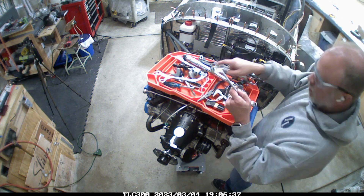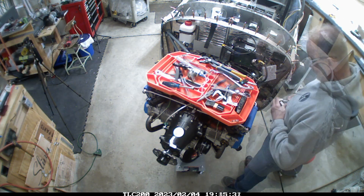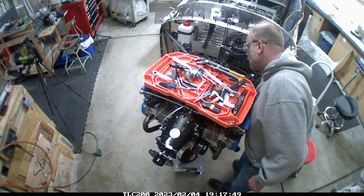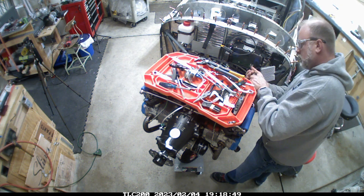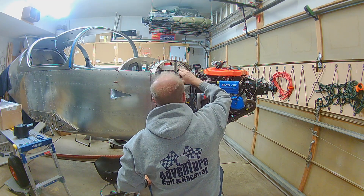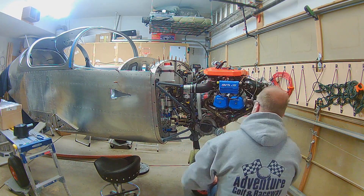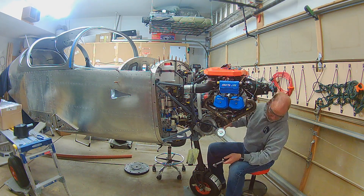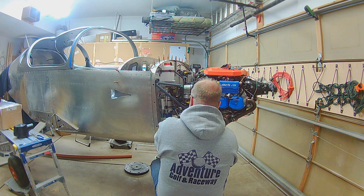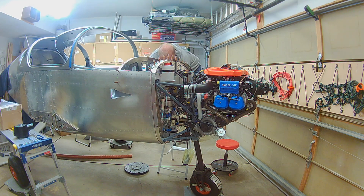In order to get the bolt in the lower left-hand corner from the front — or lower right-hand corner from the rear — you definitely need some unique tools. That wrench there is the only way I can figure out how to get it over the bolt on the very back and apply the torque. I've got three of the four mounting points torqued at this point and just need to finish that up. The wiring routing was a little weird when the engine came out of the box, and the turbo inlet hose actually needs to be taken off and shrunk down a bit — there's a diagram in the documents on how to do that.